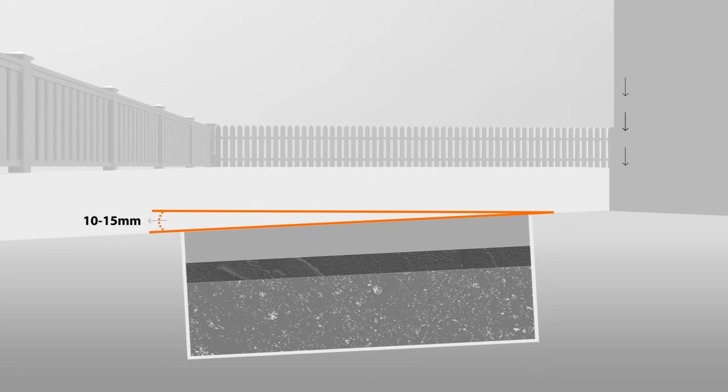With 100 mils of gap 20 laid, we can move on to our 30 mils of gap 7, also called fines, before finally laying the pavers. What I've done is taken a straight edge, I've rebated it out 50 millimetres, the thickness of my paver, and that's just going to sit nice and neat on top of my garden edging. And I'll drag those gap 7 or fines backwards, leaving the exact amount needed, so that ensures that my paver sits flush with the outside garden edge.